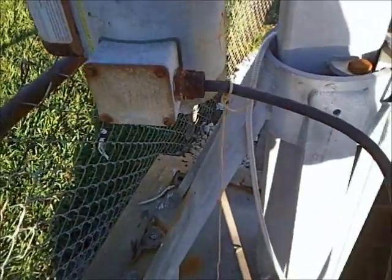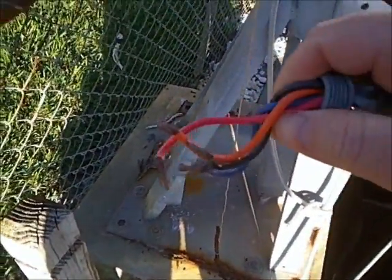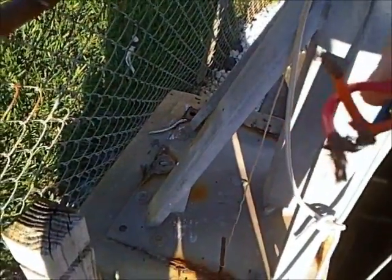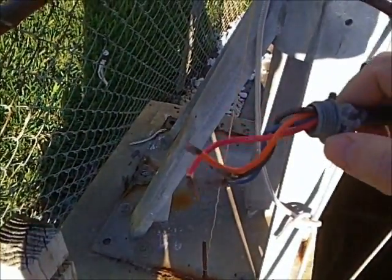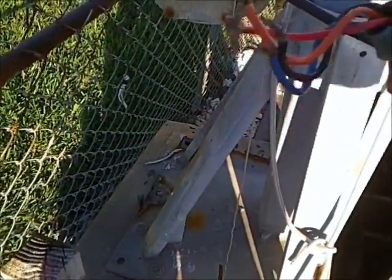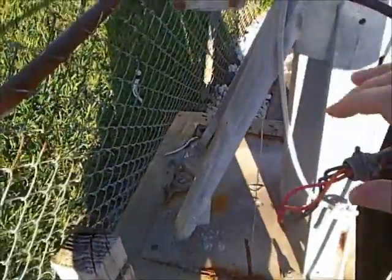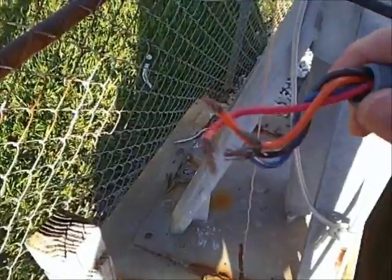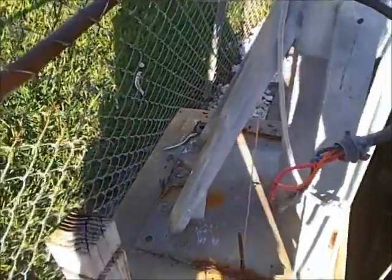As an output on this motor, I've got 4 wires coming out of here, and they're all kinds of crazy colored compared to the standards. There's no T numbers on this one, which you see referenced in a lot of the diagrams. So on my own, what I did was take a picture of where these wires were plugged in, because this one was working right, and then I'd attempt to diagnose the switch, or in past instances I'd just replaced them, bought an identical switch from Salzer, and made sure I put the wires in the right locations. But that's some of what you run into with these older wirings.